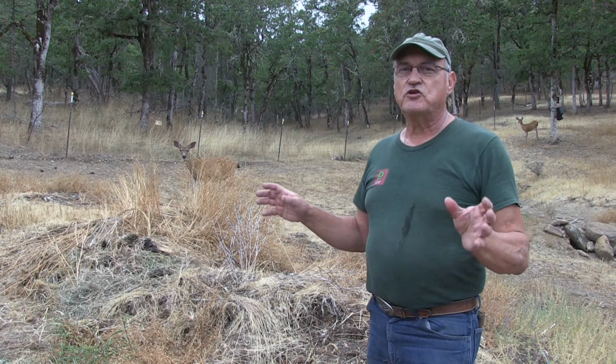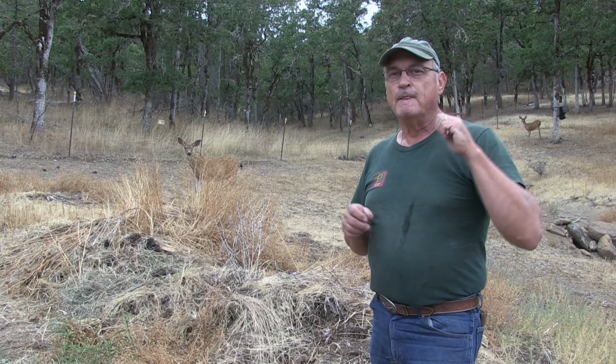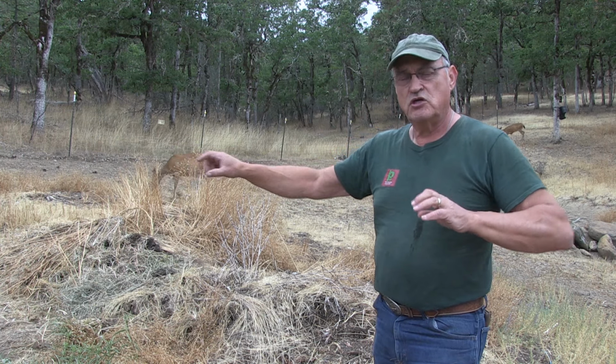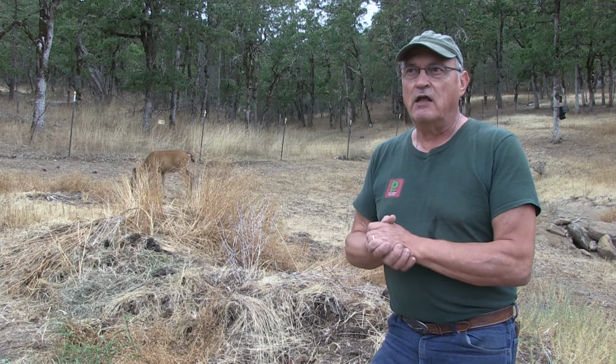So looking around for a suitable location to put the barn, I felt I'd put it right up here on the other side of the pond, because I wanted all my outbuildings a suitable distance from the house, where we're going to be placing the house. I didn't want it too close. Plus, they had to be a set distance away from the well house as per code. Livestock enclosures, you need them 100 feet or more away from your well house. Now, I did feature the well house build in a previous episode. Check that one out. I'll go ahead and leave a link for it right here.